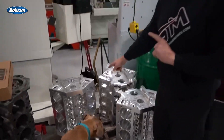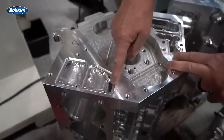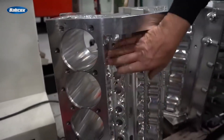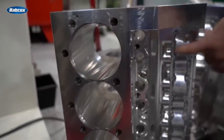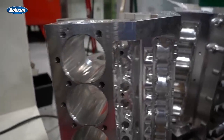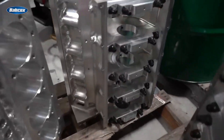We've got Dewey in here inspecting stuff. These are three of the next SML billet blocks — check that out real close. Fully billet, obviously water jacketed, water in and water out, still takes LS componentry. Notice that altered head bolt pattern — I talk about this all the time but it is important. There's actually a head stud that goes right through the intake port. Half-inch head stud here, half-inch head stud here — revised and moved for a more symmetrical pattern all the way around. Ultimate cylinder head clamping for LS.